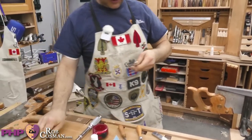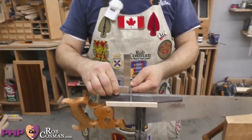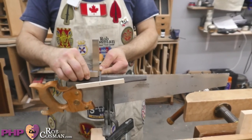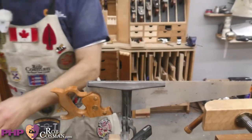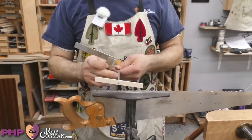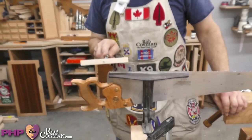Okay, so I got a relatively small piece of wood. I'm going to put the end of the file in that piece of wood. I'm going to set my square on here, and I'm going to hold that file like that. I'm going to take this piece of wood and put it on there. Let's go back and check it. So if I do that and I do that, okay. So when this cutting face is plumb, that popsicle stick is level. So now I'm going to be able to tell whether I'm tipping one side or the other. So I'm going to come in here,